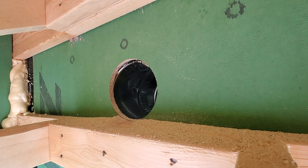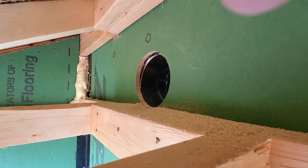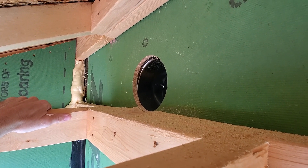This is inside the soffit — it'll be a vented soffit. I should have this come over and then turn down and hang out the bottom so we're not getting heat built up inside this cavity being sucked in or out. That'd be great for the winter and not so great in the summertime.